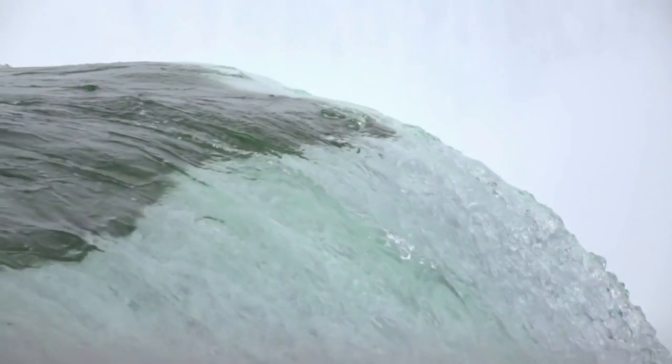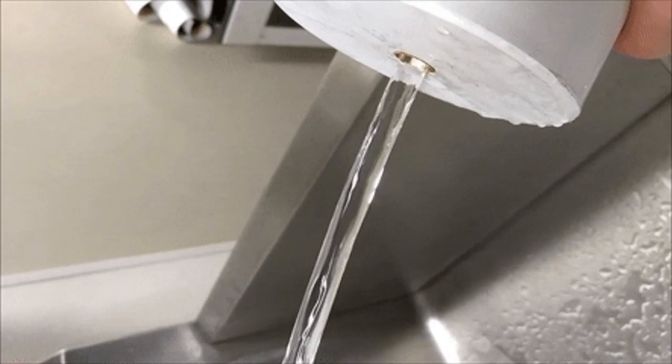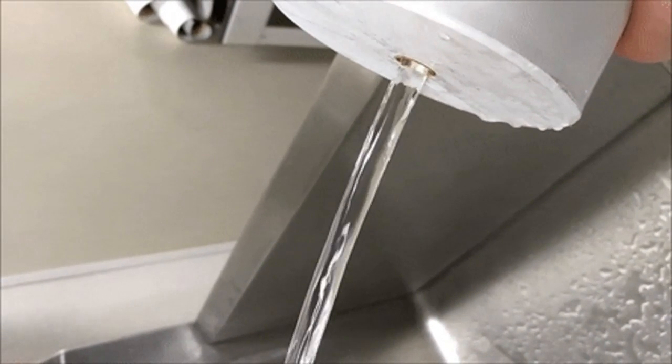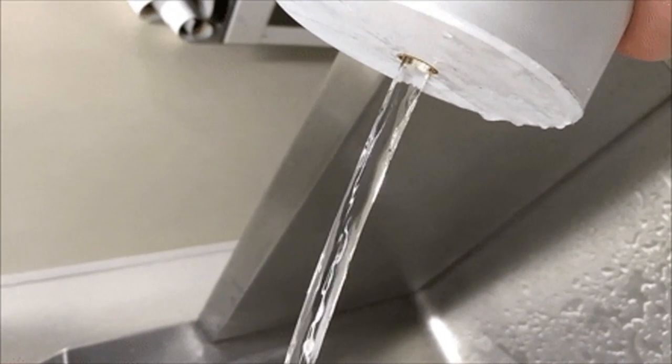In this model, it was intentional that some parts were added to aid in the occurrence of laminar flow. For example, the straws were used to keep the water straight in one direction. Small space right after the straws in the model is used so that no turbulence is picked up. The mesh is used for the same purpose, as turbulence will hinder laminar flow. Also, for the model to work, no air bubbles should be present, as it will cause disruption. Finally, sanding the nozzle is very important because it makes it smoother and helps with laminar flow. This model is a great experiment to show this amazing concept called laminar flow.